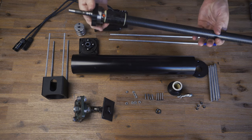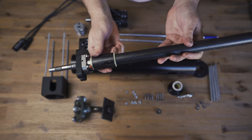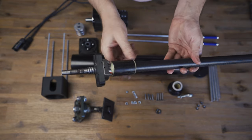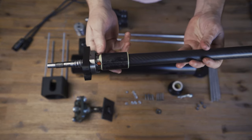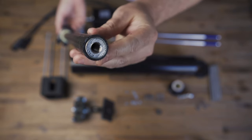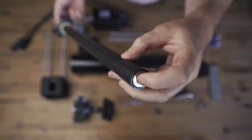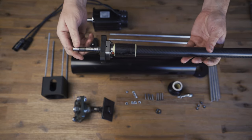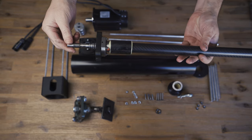The final piece is the ball screw. To attach the ball screw, I've used some steam pipe — the steam pipe fitted perfectly. It was 1mm ID bigger than the carbon tube and fitted perfectly over it. I just had to lathe machine out this end to 29mm, one mil bigger than the ball screw, and I've used some 3M epoxy — pretty high quality stuff — to epoxy it in. At the end there's a brass threaded insert, also epoxied in. Once it's all together it's essentially a throwaway item if you damage your ball screw, but to buy a ball screw and carbon rod is about $35 US, so it's not the end of the world.